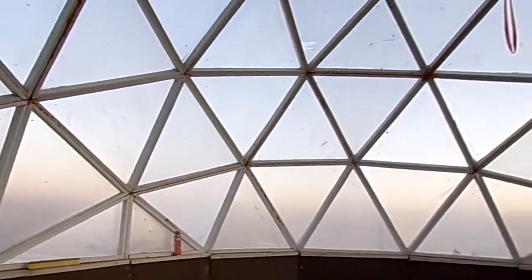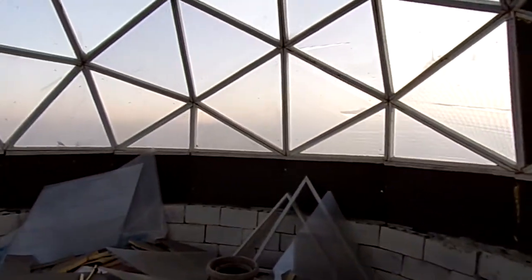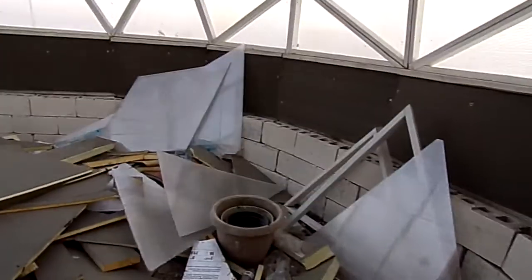This is my first dome that I built last year. This is 300 square feet, whereas my other dome is 1,200 square feet. I dug down two feet below the grade and laid the cinder blocks around it and capped it with the soil cement. I insulated the knee wall and the north side as well.